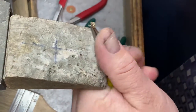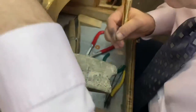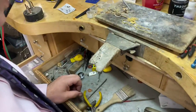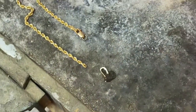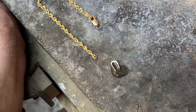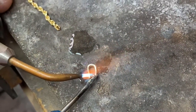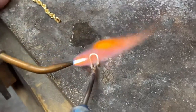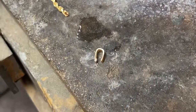You could do this on the chain, but since the chain is so thin it's going to be very difficult. Here's the key: when you make the end cap, we're going to take the solder and instead of putting it on the actual chain, we're going to put it on the actual end cap. Make sure you flux this, then add the solder — be a little generous but not too much; you don't want the solder going everywhere. Let it flow inside, and heat from the back so the solder sticks to it.